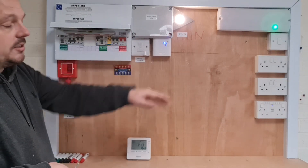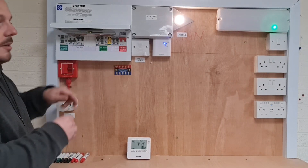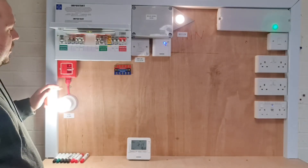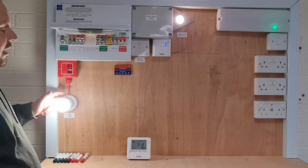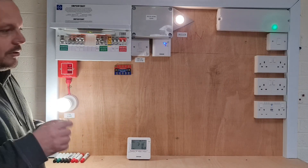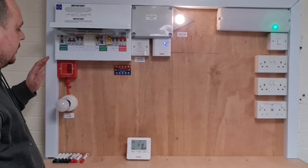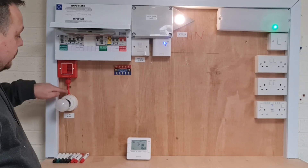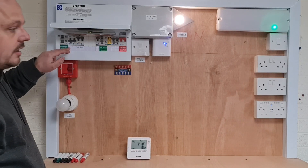So the emergency light and these sockets here. And you'll see the fire alarm - I've actually labeled it as smoke alarm, I should say fire alarm - is on a key switch and if we pop that down, you can see the neon illuminates on the fire alarm spare and the lamp comes on, which is simulating the fire alarm control panel because I don't have one of those. If I pop the power off to that as well, that allows isolation at this point, and of course we can get test readings from here. I've used FP200 into the consumer unit as well, and we'll have a look at that in a minute.